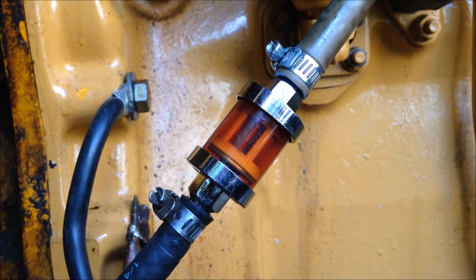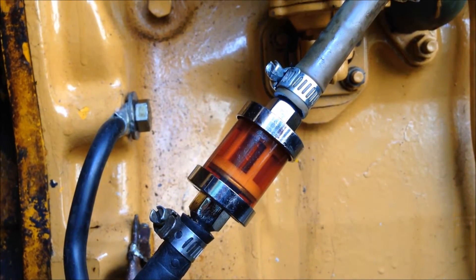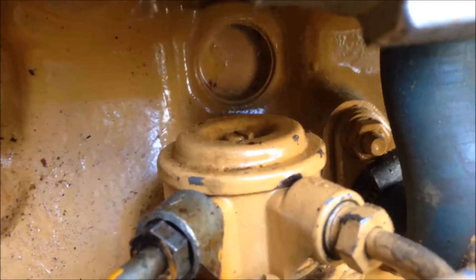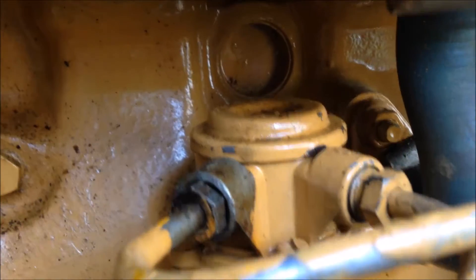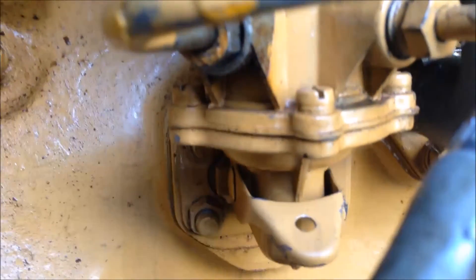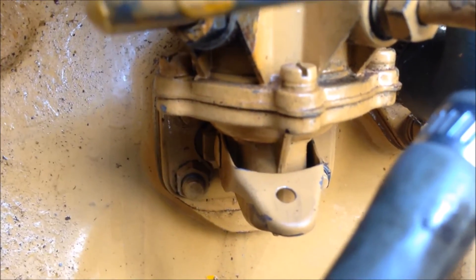If it's plugged up, I can just clean it and put it back together without any trouble, and avoid having fuel issues trying to get the thing primed again. So I've got the basic filter here, but there are a lot of filters on this. If you come up to the top, that piece right there — if you pull that screw off, there's actually another filter in there. The fuel comes in on this line, gets filtered, and gets pumped on out. If you have any fuel starvation issues, clean that one up too. Very nice design on this pump for being able to prime the system.